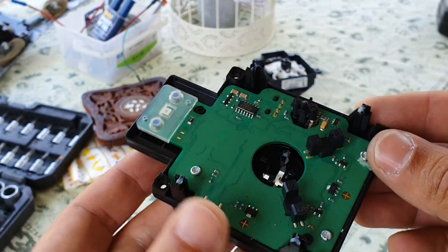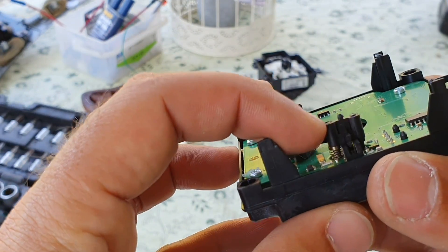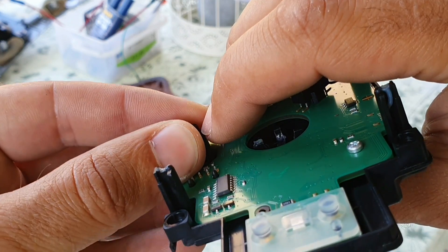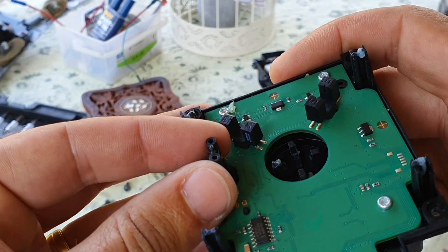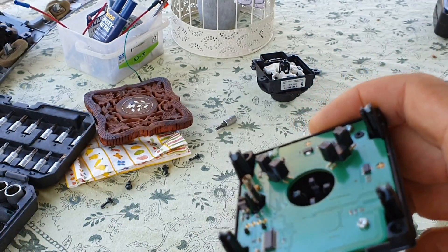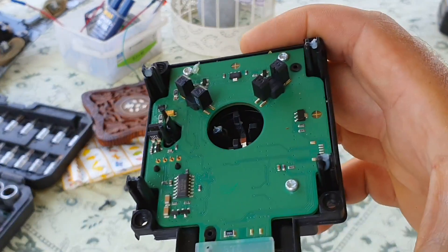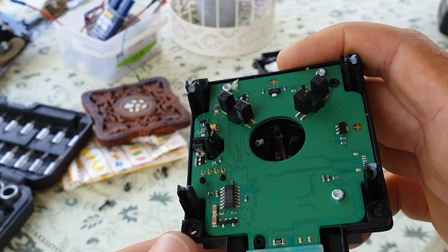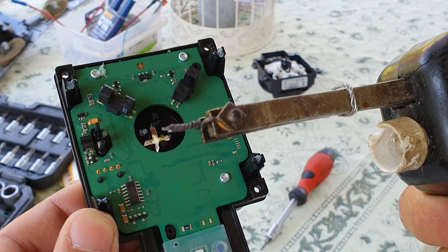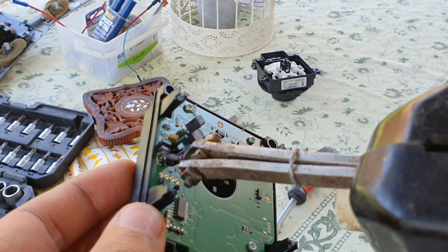After inspecting a little bit more I didn't find anything else, so we are going to try to solder this cracked joint. To do that we have to remove this plastic button — try this here — and now the button will come out, but be careful because there is a spring in there. Spring is out, now we have more room to solder. I couldn't find my soldering iron with the smaller tip, so I'm going to try with this one.